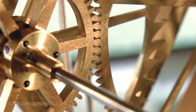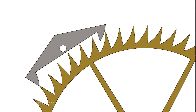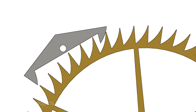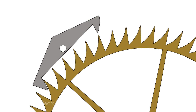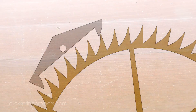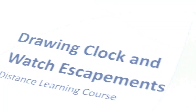Now there are many different escapement designs, each with their own pros and cons. The one used for this clock, the recoil escapement, is so named because it experiences a small backward recoil every time it ticks. This recoil action is well understood to be one of its flaws, but its relatively forgiving geometry and robust performance made the recoil escapement the workhorse of the domestic clock market for many hundreds of years. In fact it's still widely used today.